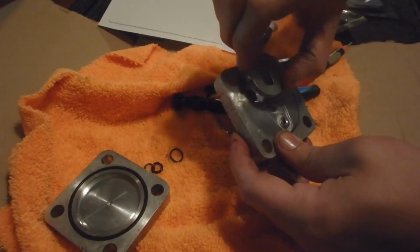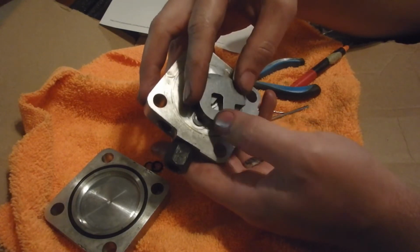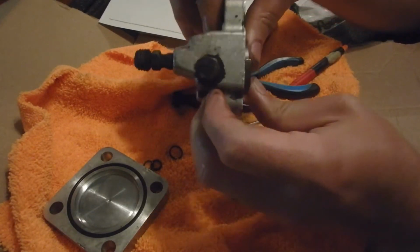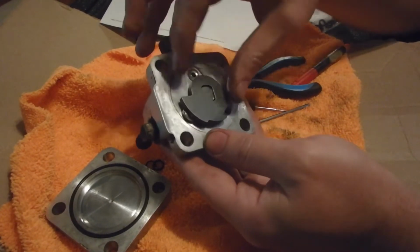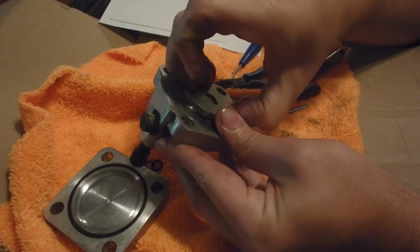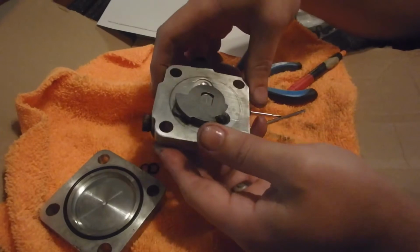And the way this thing works is it's going to rotate around this valve. Yes, that makes sense. And as it's down, that will actually cover, well, you can't really push it in. That'll pretty much cover that valve. So, anyway. But this thing will rotate around depending on, and it'll fill or send to the struts and take fluid away from the struts, depending on where the position is.